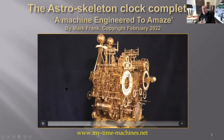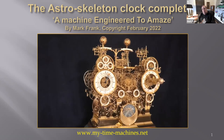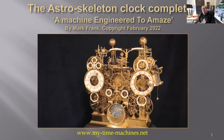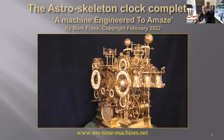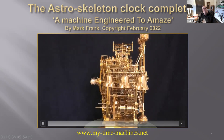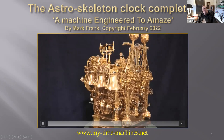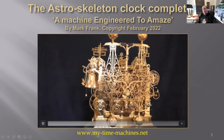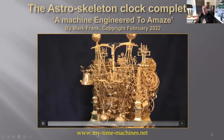So what we've done is, every arbor that is lightly loaded and turns less than once per hour runs in a dry jewel bearing. Every arbor that runs quicker than that and is lightly loaded, like these fly fans up here, these governors for the remontoire, they are oiled, but they're right outside here. They're very easy to get to. And then anything else that is more heavily loaded runs in these ceramic bearings, no matter how fast or slow that they go.